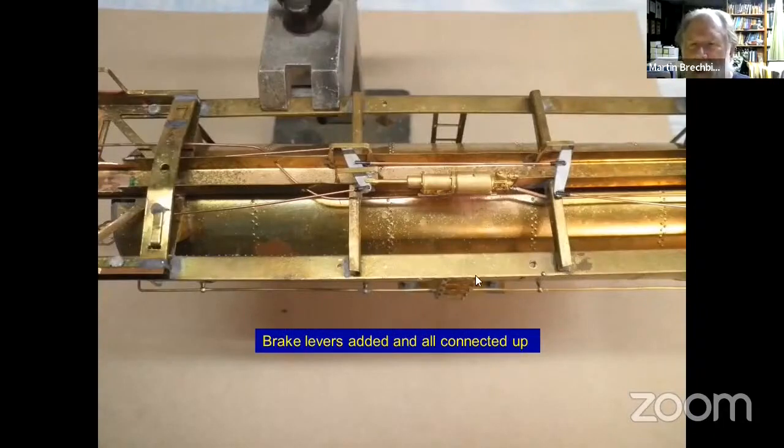Okay. In this case, what I did, this casting was upside down in a clamp with flux under it. I heated that up and actually put a puddle of solder on the casting. So there was a good healthy film of solder underneath this casting when I laid it on top of here. And then heating up this casting without heating anything else around it. So the flame from my torch is hitting this casting only. I am not touching anything else as much as possible. As soon as it's hot enough to melt that solder, that torch is off of it.